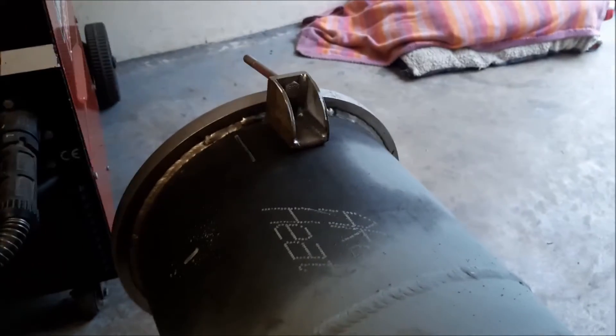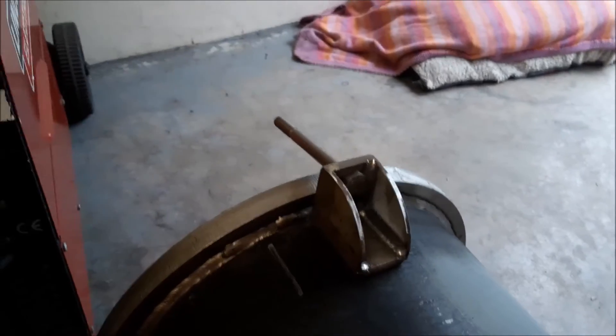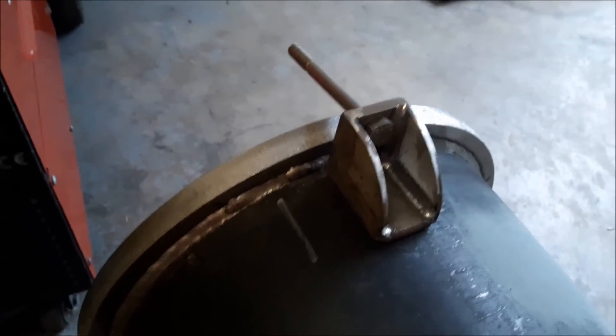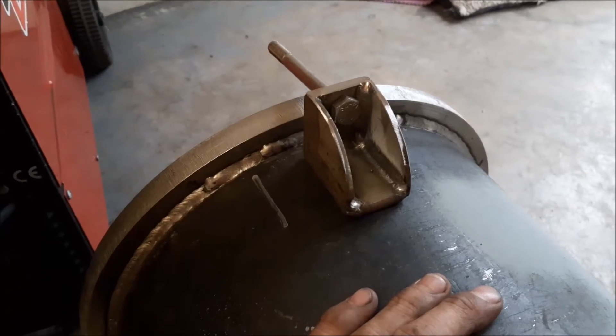Right, I've finished four of them and I've just put it into position there and I think that looks okay. I mean I'm sure this is going to work. I'm kind of feeling at the moment like I wish I'd just drilled holes through here like I did with Jody B, considering the rigmarole of building these brackets. The reason I did this is it was awkward to machine with the discontinuous cuts — went through loads of tooling doing it. But I don't know, this seems to be quite a palaver as well. Also I'm thinking I bet there's something you can buy off the shelf like this that would have saved me having to mess about making them. But anyway, I'll have to carry on because they'll have to be all the same now.